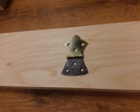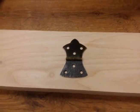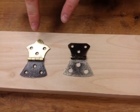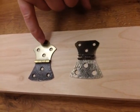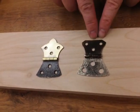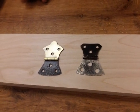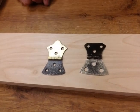With a little bit of grinding and pounding, you can reshape this to make it into whatever you want. This is one that I'm in the process of working on. The first thing you do is grind off the points - you grind off this big point here and a little bit on the sides to end up with that shape. I did it with a bench grinder, but if you don't have that, you can certainly just file it off or even saw it off with a hacksaw.